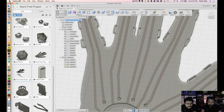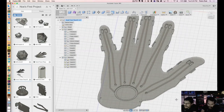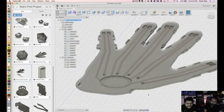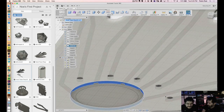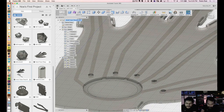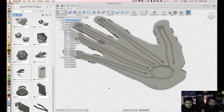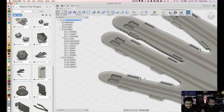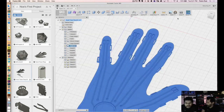And as usual, we'll have to use those traces to actually cut away from the main glove geometry. If we zoom up here, you can see all of the little tunnels that all the traces create after you cut away all that material. So you always want to do that, folks, when you're doing dual extrusion, because you cannot have the two parts intersect with each other. If you do, you're going to bridge the traces. Very cool. As I was saying before, when you're tracing this out, you want to make sure you leave some room for the little tabs that have the slits where the straps will go in.